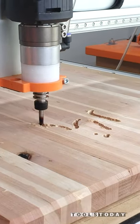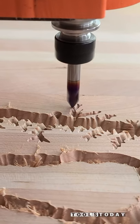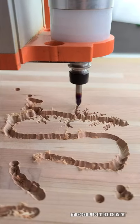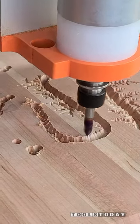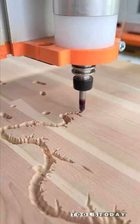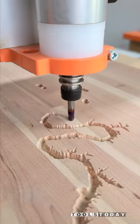I'm carving the map of the Lake of the Ozarks into this cherry board. I'm using the 45624-K, quarter inch diameter, 60-degree V-bit. You can see it going through here and picking up all of the fine details. It went down at a single pass depth to create the dots that we are connecting, and then we're going to come back with a full pass depth to get all of those really fine details in the lake shoreline.